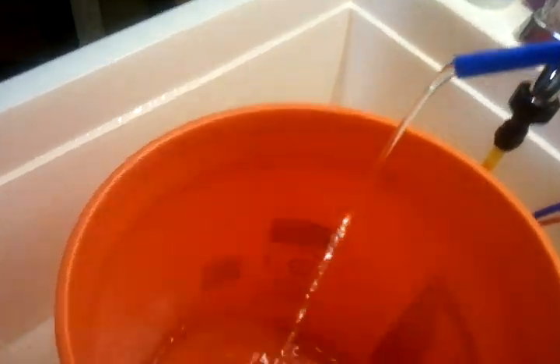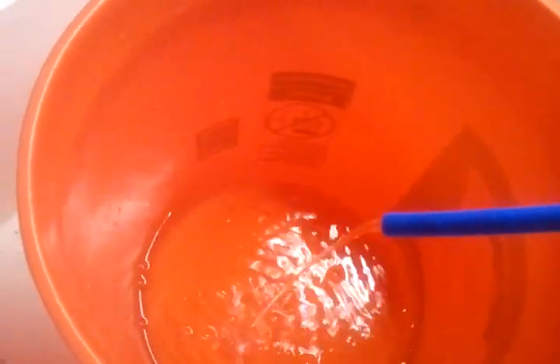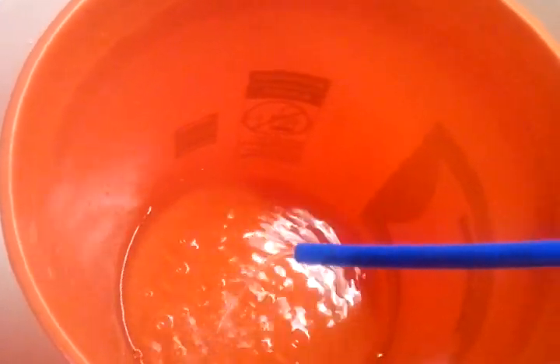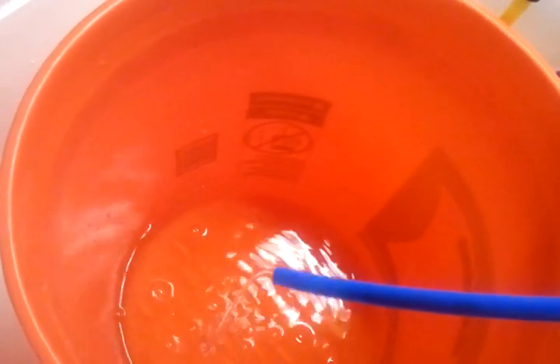As you can see, it's not much flow, but this is a five-gallon Home Depot bucket which I just emptied. It had about two and a half gallons in it after about an hour. This is a 50-gallon-per-day unit, which roughly translates to about two gallons per hour, so I was actually getting a slightly higher flow rate than they suggested.